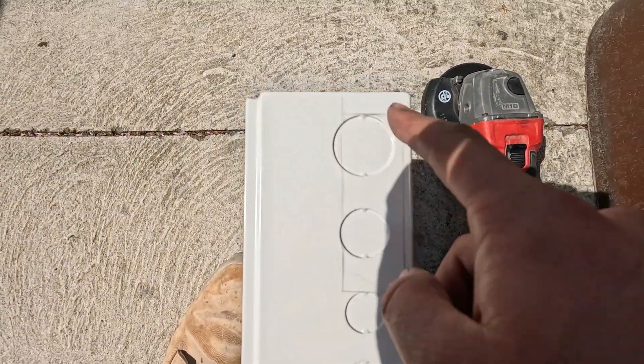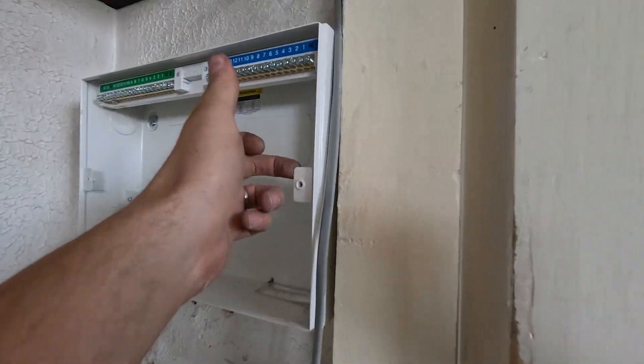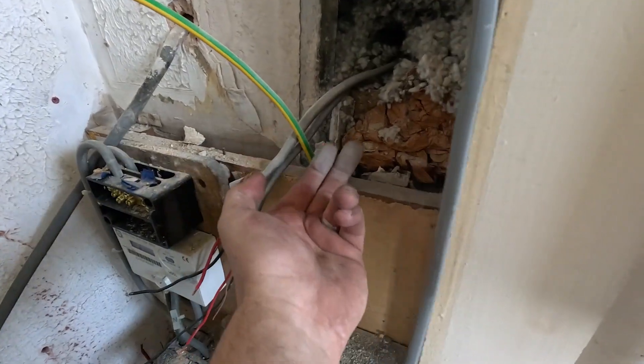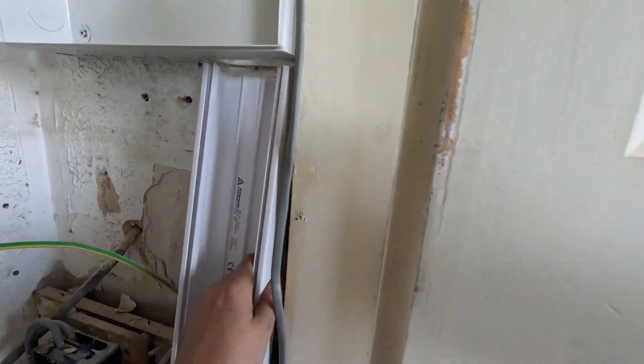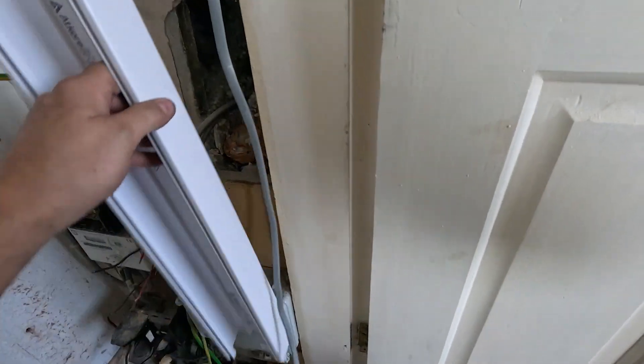That's really interesting - cake time! The conduit was super soft. Ten out of ten for the cake. Right then, safety first. I've marked up where the 4x2 is going to sit - I'll get this little bit chopped out, get it grommeted up, and then get this fuse box mounted. There we go, got it straightened up. Going with the Slimline today. I'll get this piece of trunking up, chop it down in line with the top, cables can come up and into it, and finish up nicely once you get the lid on - a nice neat sweet job.